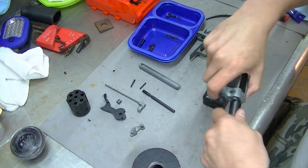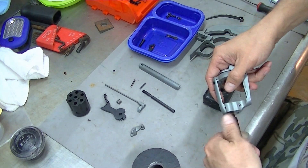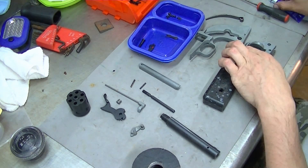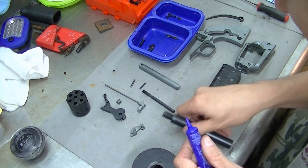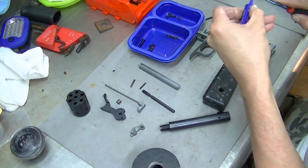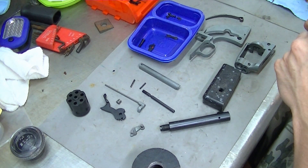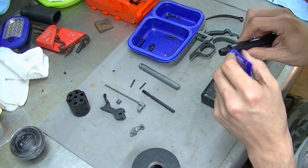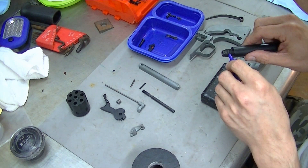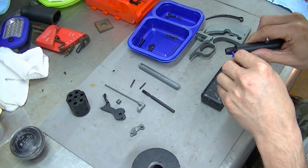We're in good shape there. I'm actually going to put a little Loctite on this one — it already had a little slack in it. So I'm going to Loctite it to ensure that we have a good lockup and everything's good and solid. If you don't have any way to really grab hold of this barrel solidly, you might want to think before using red Loctite on it — maybe look into the blue. I'm going to put a dab in the pinhole there.